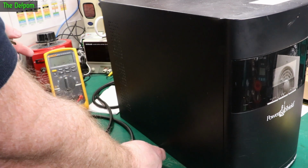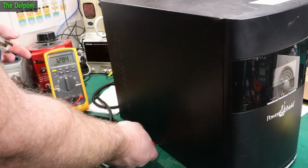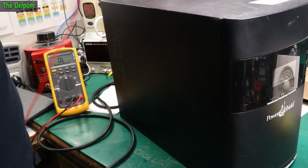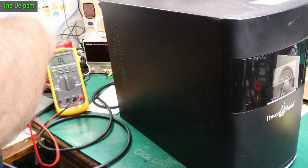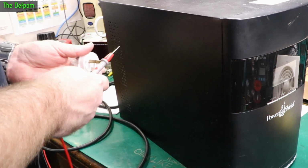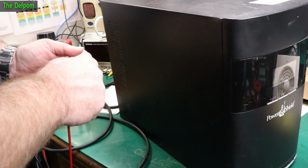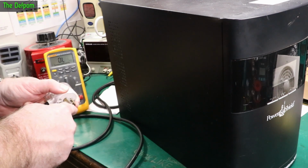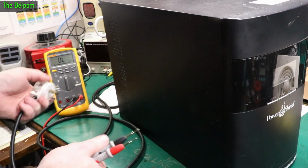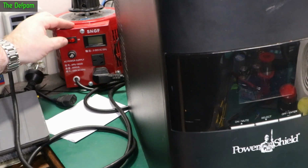make sure it's actually got a decent connection. Going to a screw there, come on, get through the paint. Let's go to the back panel, we've got a decent connection. Yeah, 0.6, so yeah, that's earth, that's alright. And check for any obvious faults. We've got megohms to there, megohms to there, and across these two, megohms to there, so there's no obvious faults, that's alright. I'm happy to plug that in. Let's turn the power onto it and we'll see what happens from there.